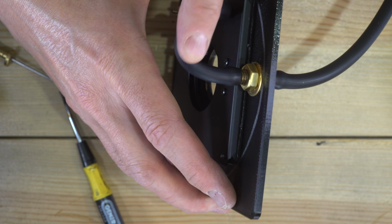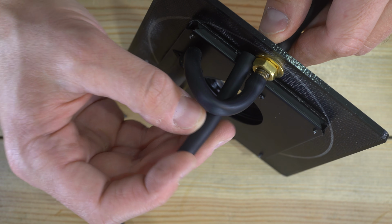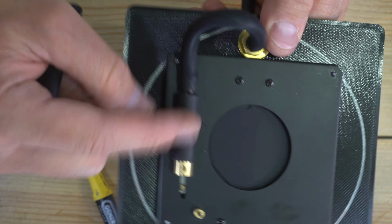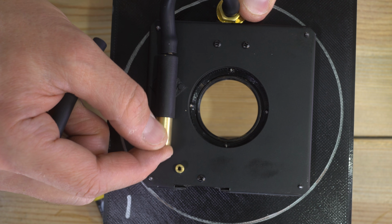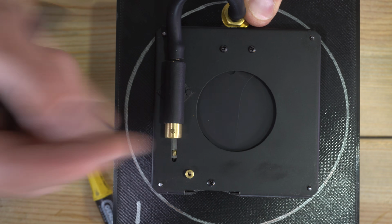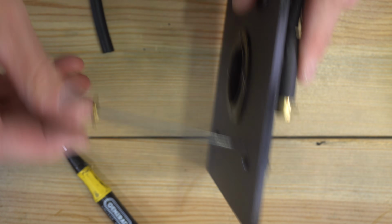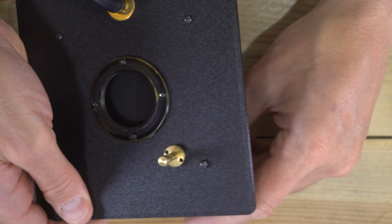Okay, so first time I tried fitting up the hose to the back of this, I used this piece right here, which was too short, and it crimped, cutting off the airflow to the piston right here, and that meant that the response time for this was very slow, and there wasn't enough air reaching the piston for a time exposure. So the last thing we have to do is get the instant pin mounted. I've already gone ahead and drilled some holes for it.